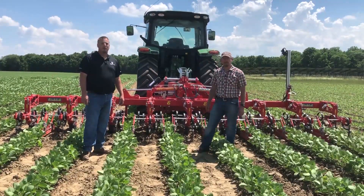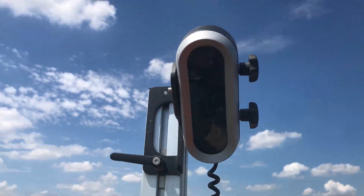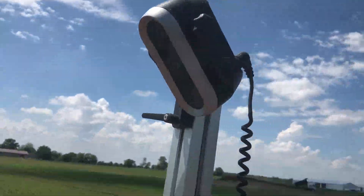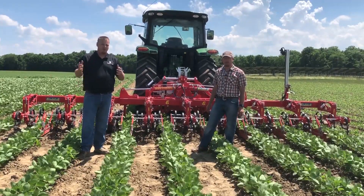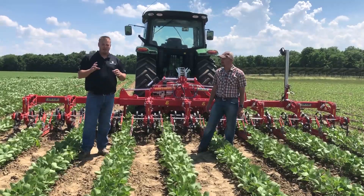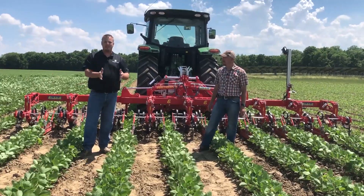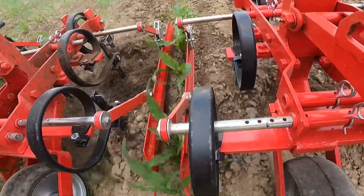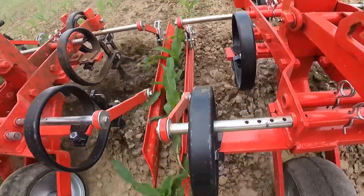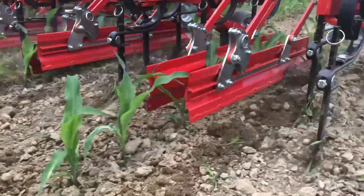So the row guard is really, really cool. It's hydraulic driven, and it's got a camera on it looking at the row. On the monitor, it's got a setup page where you need to tell it how wide your rows are — whether you're in 30 inch rows, 20 inch rows, whatever you're in. Then you've got plant height and plant width, so you tell it in inches how tall and how wide the plant is, giving it an area to look for. It's got a really cool auto center button — as you pull in there, you center up on your row, hit that button and it'll find the row, center it up, and all you've got to do is drop it in and go.